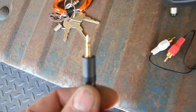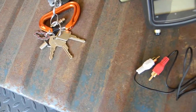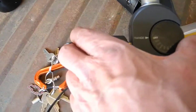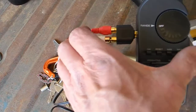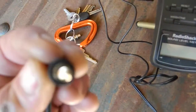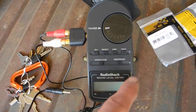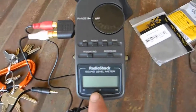That jack plugs into the camera's microphone receptacle, and then I'll take the stereo plug into my Y adapter, which brings it down to a mono signal feeding into the stereo plug going into the camera microphone. The signal is direct with no processing going on.